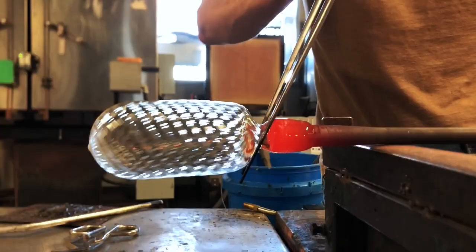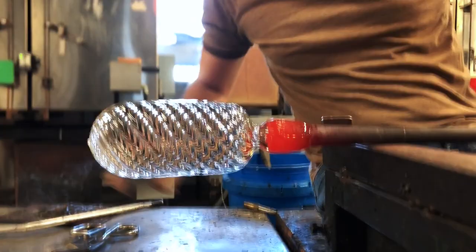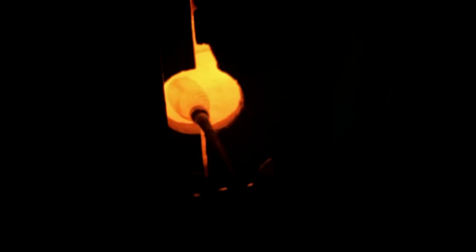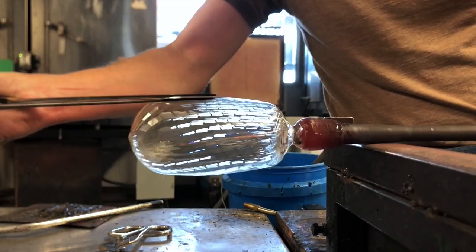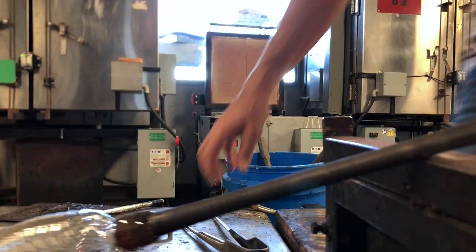That shaking you see is actually my phone glitching out because of the heat — the radiant heat coming off the glass. The same reason why I'm tilting my arm over to one side. It just messed with the stabilization of the phone, and I didn't know it until after I looked at the footage. I actually had to reset my phone to get it to stop. Then a shot of heating it in the hole — we got it a little too hot there. You can see it wrinkles a little bit. The only thing you can do to rectify that is blow the bubble up a little bit more to get the wrinkle out, but it's not the best solution because you end up thinning the bubble too much.